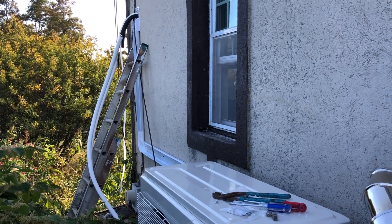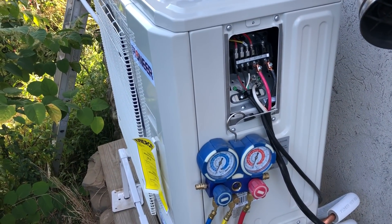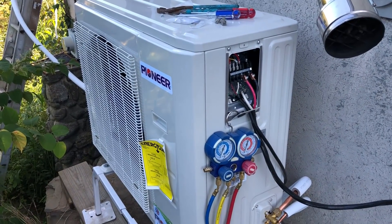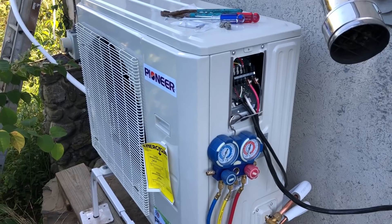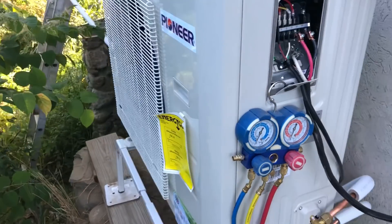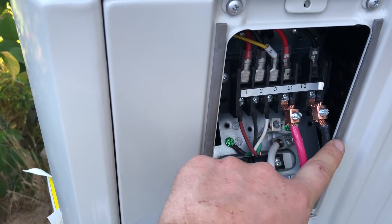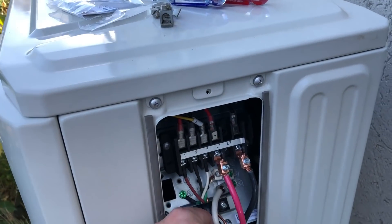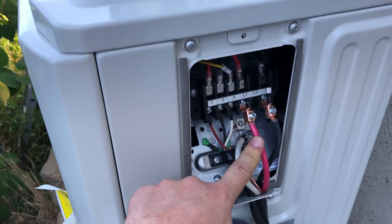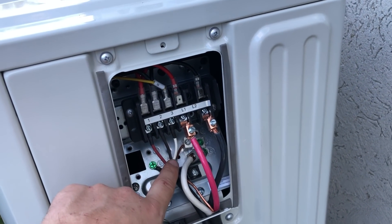It's actually the next day — we had our vacuum running and left it off overnight to see if we had any change in pressure. We did not, so we're looking at negative 30. The key thing is once you turn your vacuum off, you want to make sure it holds that pressure. I would leave it for a couple of hours minimum; we left it overnight, about 24 hours, and had no equalization of pressure. If you had a leak it would move up to zero. We've got all our electrical connections done — we've got our common, our neutral grounded up since there's no spot for neutral in this unit, and here are your two power wires. Make sure the same wire colors here match the ones you used on the inside unit.